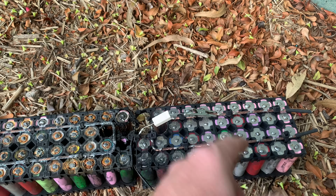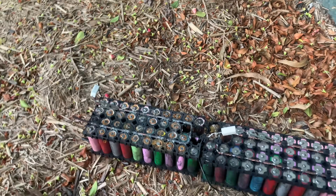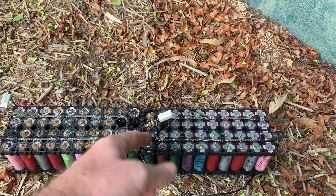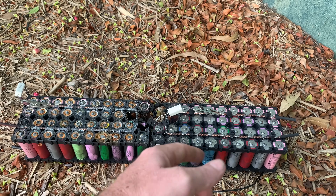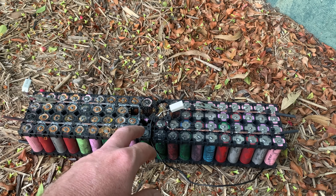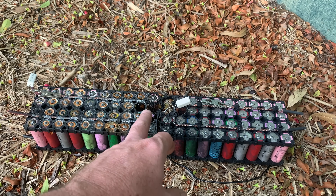It's about 2 amp hours, so those 80 amp hours — it's going to take about 80 hours to get that dead flat, give or take. Look at that rust. On that note, a couple of people have said you should have had a fire extinguisher. Now, that's all well and good — that would have put the fire out within these plastic clips or that grass. But the fire extinguisher — how long does it last? Minutes, if you're lucky. And the thermal reaction is still going on. As soon as you run out of propellant, you've run out of ability to do anything with your batteries. They were put in water, and I think that's actually the smartest thing they could have done, because that killed the thermal reaction and stopped anything getting any worse.